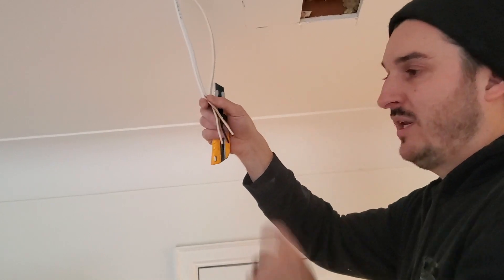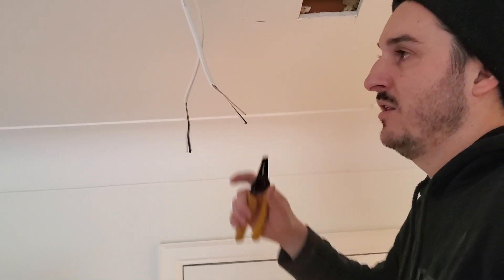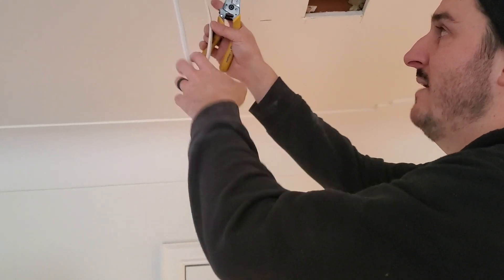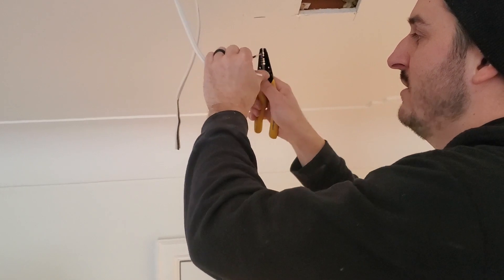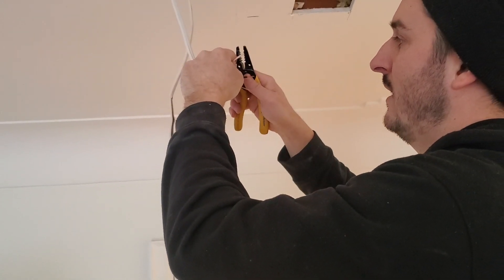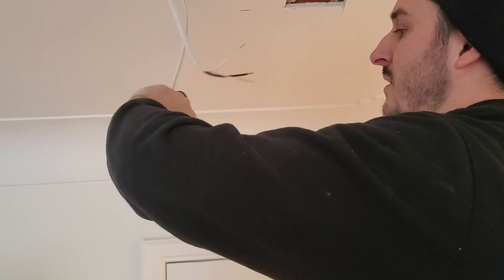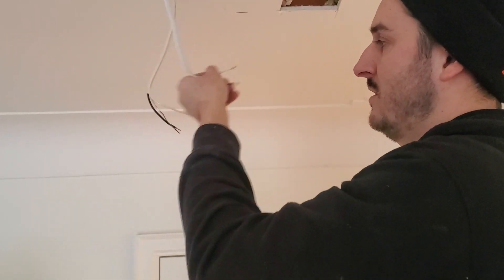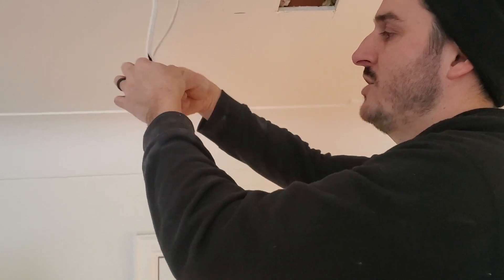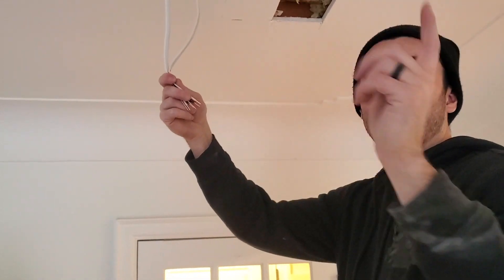The reason we're leaving these so short: in a plug or a switch you wouldn't have them this short, but here the junctions are really small, so we make this end of the wire quite a bit smaller. We still have some excess here in case we need it, and then you strip just over half an inch of each end to prepare your wire. These are ready to go into our junction boxes — that's what you do for each one of them.